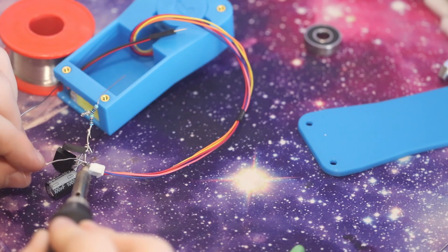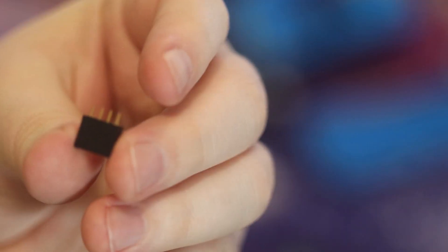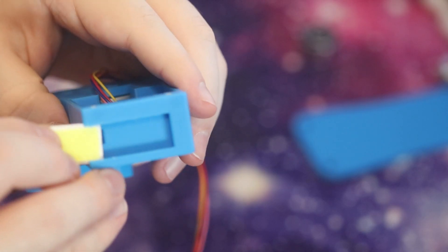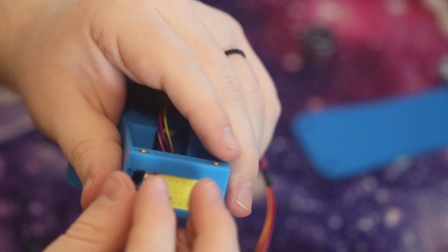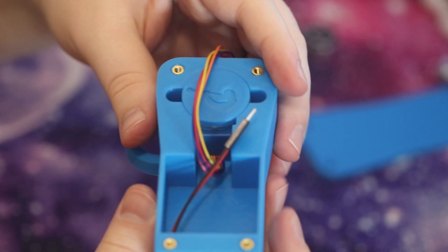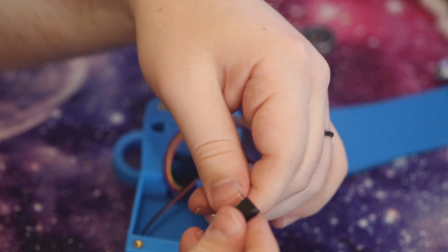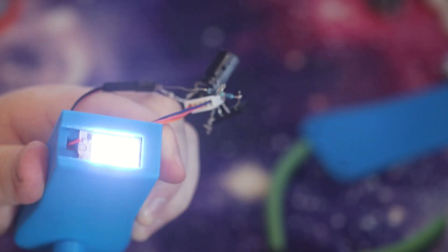To help remedy this, I added a big capacitor right at the positive and negative terminals of the bridge rectifier IC, then about a thousand ohms of resistance between the capacitor and the positive and negative terminals. I soldered a little female header to make it easier to connect to the LED, and slid the LED's wires through the little hole in the body. I highly recommend building this circuit on a breadboard first so you can test different capacitances and resistances. I've seen some people do this with a Zener diode, but that seemed wasteful. This is just a for-fun project and I'm not selling these, so I was okay with what I got.